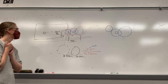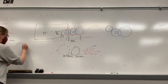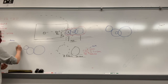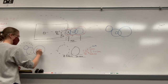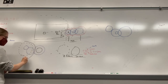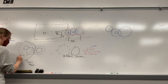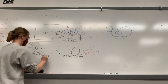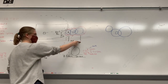That gear is fairly constrained in where it can be, because it has to be far enough up on that circle so that the radius of the CVT is at least that far up across the bottom. So those are all different constraints that you start to get with the gearbox. The minimum distance is because if you take the gearbox, the primary or secondary of the CVT has some radius, and then you have some half-shaft CV joint. You need some clearance here between the CVT guard, the secondary, and the half-shaft cup, otherwise things are going to intersect with each other.